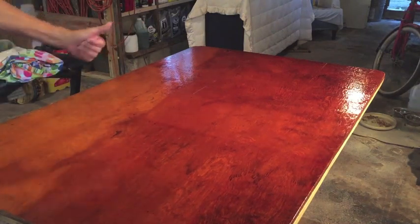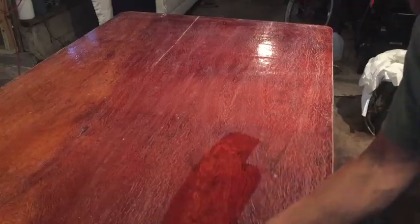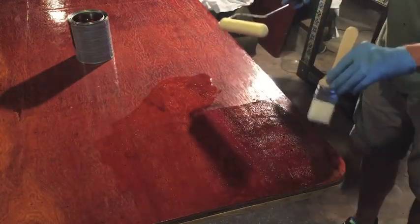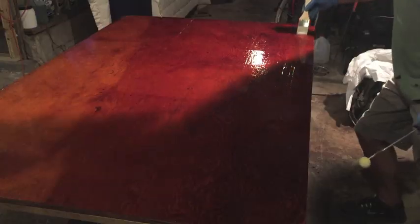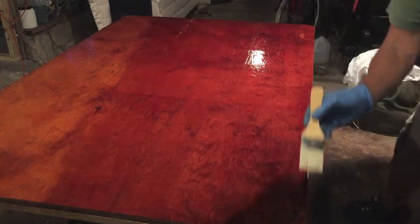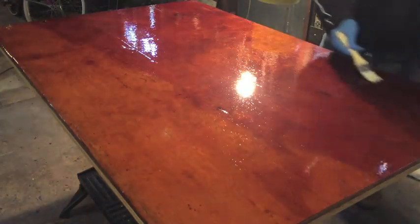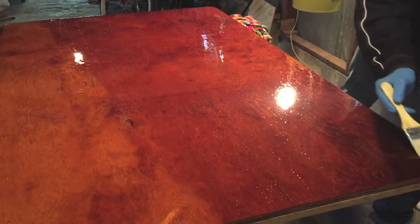More polyurethane — that's what's next. A light sanding between coats of polyurethane to help with adhesion, then wipe off the dust with mineral spirits. Coat number two — let it dry overnight. Finishing up the third coat, which I'll again let dry overnight and put coat number four on tomorrow. Last coat of polyurethane — the fourth coat — and that is it.